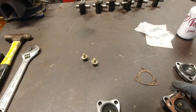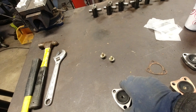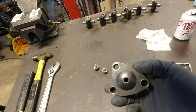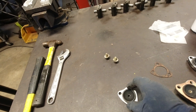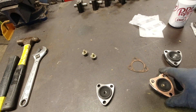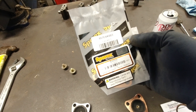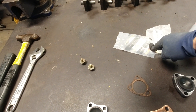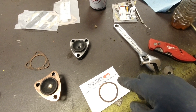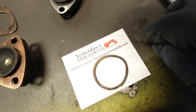I want to show you a project we're working on — our Perkins project. These are the combustion chamber caps on the indirect injected Perkins 3152. These are actually replacement ones — you can see they're domed on the back side, that little bulge in the cap. Typically they're flat on the original ones. The previous owner had bought new caps trying to get the indirect combustion chambers to seal. These are the new gaskets available, made by Spirex. There are other people who make these gaskets too, but they're all very similar in that they're triangular shaped. The original gasket was a round gasket. And if you notice, this particular gasket is not round any longer — it's oblong.